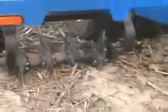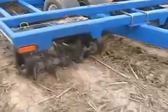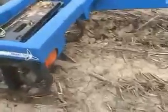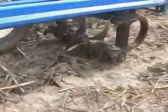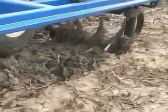The purpose of this presentation is to help you to understand the inner workings of soil aerator technology. The technology is designed first of all to not invert the plow layer, but to effectively penetrate it without mixing the various strata of soil biology. By gently and effectively loosening soil, it creates new opportunities for rooting activity and provides for rapid in-soak of water